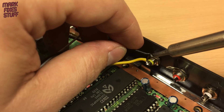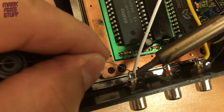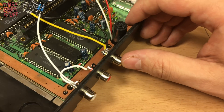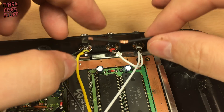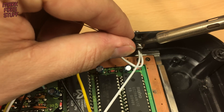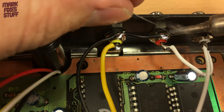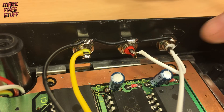We solder the video signal wire to the centre of the yellow RCA socket and ground to the tab. And solder the audio signal wire to the centre of the white RCA socket. We're installing a bridge wire between the centre of the white RCA socket to the centre of the red RCA socket — this will pass the mono signal to the left and right speakers of the television. All the grounds are linked on our mod board, so I've stripped a piece of wire in three places which I'm going to solder across the tabs of our outputs. It's a much simpler way to connect ground to all three sockets and it doesn't make any electrical difference.